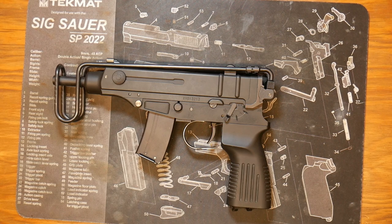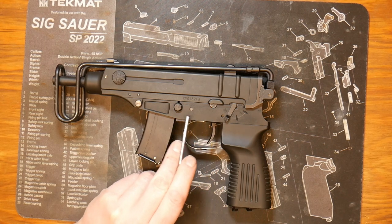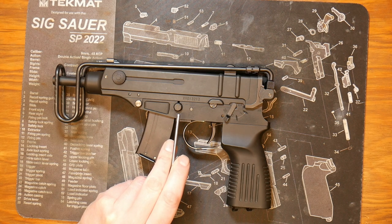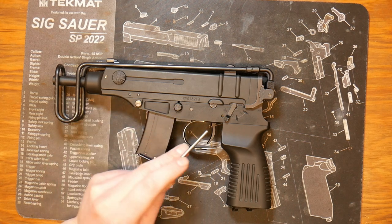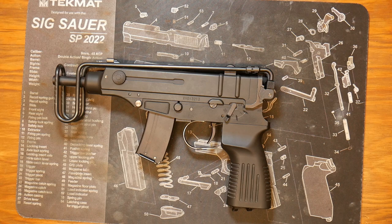We're doing this for the purpose of one of the main repairs that these rifles, or submachine guns, need — a repair where the selector switch over time will wear on the magazine catch, so your magazine catch will stick further and further out and eventually not work. We've got kind of a pot metal magazine catch, and the selector bar is made out of steel.